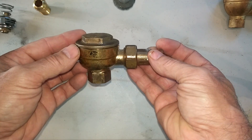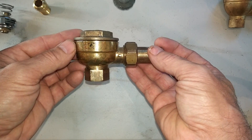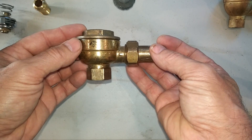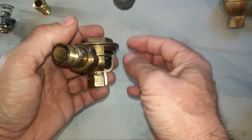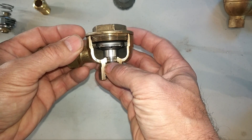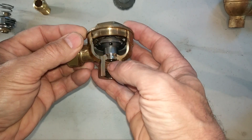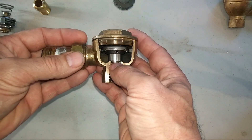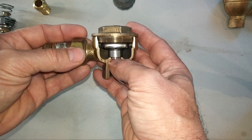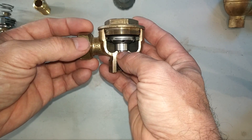I'm going to start off by saying I don't really like this trap very much. It has several what I consider fatal flaws. The first is that the thermostatic element, called a Durastat, has a very, very small outlet. So unless you're installing this on a radiator that tends to overheat or is a very small radiator, this would not by any means be close to ideal.